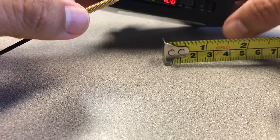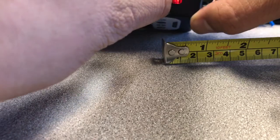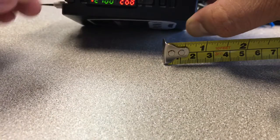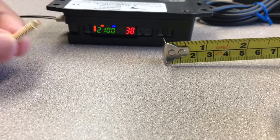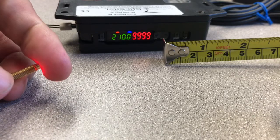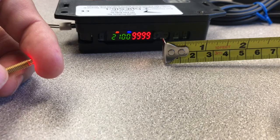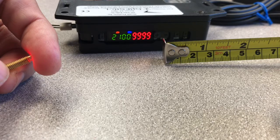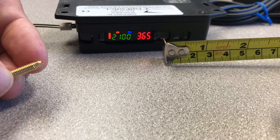Now, the other feature that's interesting, and it'll require you to probably use the fiber optic, in this case it's this little LD, and you'll see it right there. You can see the LD. If I press that one time, now what I've done, I've flipped the way the fiber optic is used to being seen. So now you see that the activation's always on. What turns off the activation is when I cover it up. So there's no activation. So this is working reversed, right? So normally I have to break the beam, and now I'm actually having to keep the beam covered. And when I get away from it, then it sends an activation to the chair.